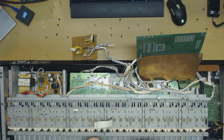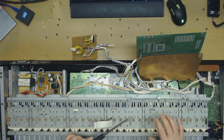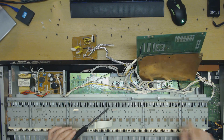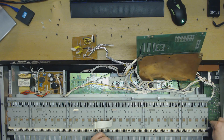There's one thing you need to remember before you remove this: there is an aftertouch connected to it. This is one of those keyboards that has aftertouch — not just velocity sensitivity where it feels how fast you press the key, but aftertouch, just like when I was playing vibrato with my hands. There is one sensor bar under here — a resistor strip, I think — that you have to remove. It's this little flat cable right here. Remove this one before you remove the keyboard, otherwise you risk ripping it off.